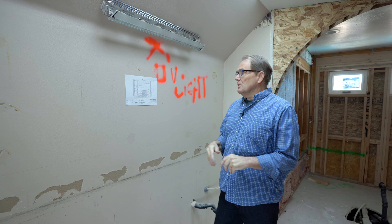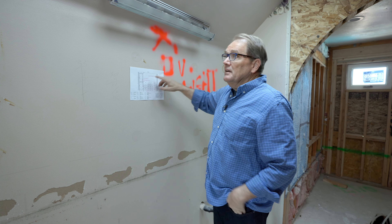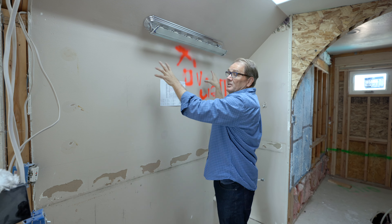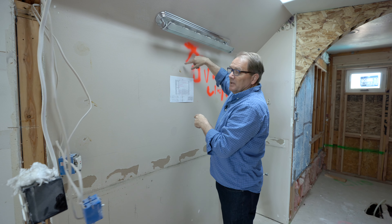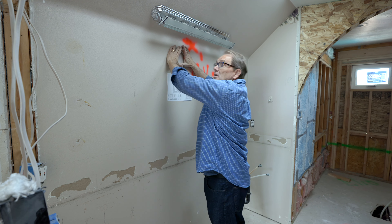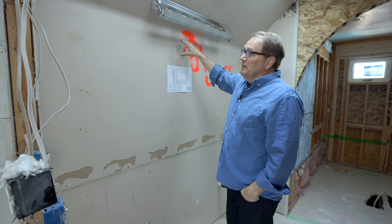Let's go upstairs and I'll show you a nightmare. We're upstairs in a master bathroom and we have the same thing here — cabinetry, counters, uppers, built-ins, showing where we want power, outlets, lighting, vanity lights, and upper can lights. Now, something to keep in mind when it comes to a vanity light: you may not know exactly where to put it. So what the electrician will do is take some 14-2 wire, coil it up inside a bay that's really close to where it's going to be. All they have to do is drill a hole, reach in there and grab it, and wire up the feature. You don't necessarily need to know exactly where that J-box is going to go. Sometimes I've seen that wiring six feet long inside the bay so you can really decide later where you want to put it — just as close as you can to where you think it'll go.